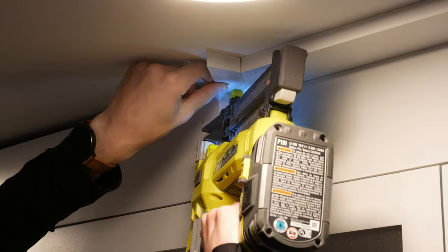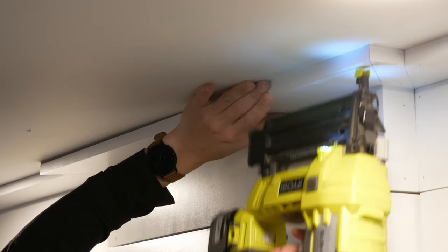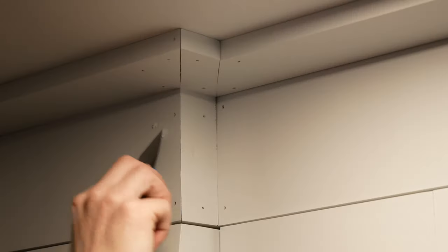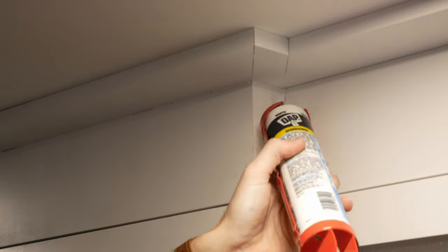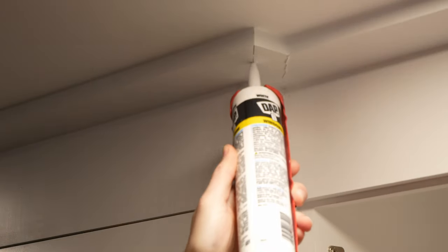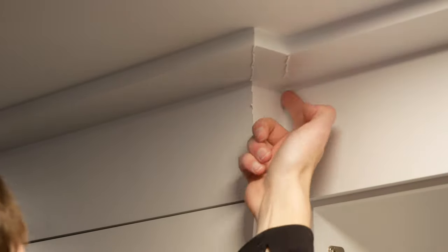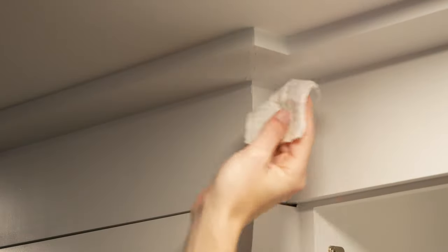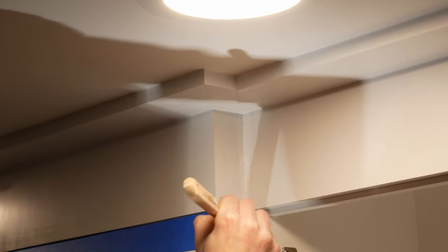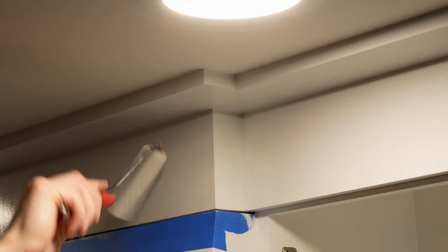The upper part of the crown is a 1x4 that butts up against the lower part, and I attached this by nailing it to the ceiling, being sure to tack it to the ceiling joists where possible. I filled the brad holes with spackle and when dry I wiped off the excess with a damp paper towel. I used a flexible caulk to fill all the seams between the boards starting with the 90 degree corners, then saved the miter joints for last as these were a lot messier. I pushed the caulk into the joints and cleaned the excess caulk off with a damp paper towel, being sure to wipe across the joints and not down them.